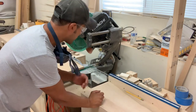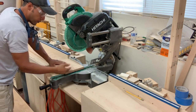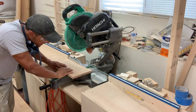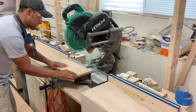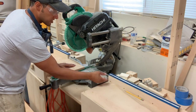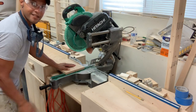You'll notice I made a slight pencil mark on the fence on my saw. What that lets me do is bevel the saw, cut my 45, and then pin the piece right up against that mark after cutting the 45 — put it right there and then cut my 90. This way I have equal pieces. I could have set up a stop block, but I went ahead and clamped it to the fence. This is another easy way to do it — just make a mark on the fence and you can erase it later.